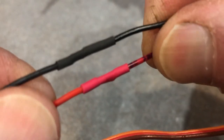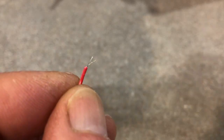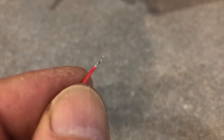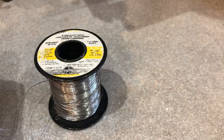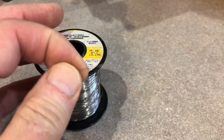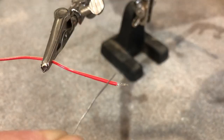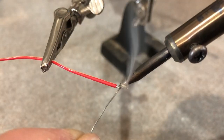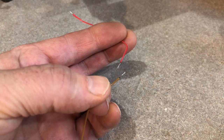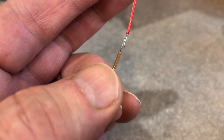So there we have it — two insulated wires ready for a plug and connection to a LiPo battery. So here's some 24-gauge wire; it's pretty small. Again, the first thing we do is wind up the strands so that they hold together. For soldering small diameter wire, I use small diameter solder. This way I don't end up with a giant blob of solder on the wires I'm trying to solder together. Pre-tin the wire. Over the years I've developed the skill of being able to hold two pieces of wire in one hand and solder with the other — I consider it my superpower.